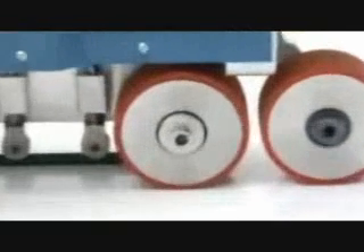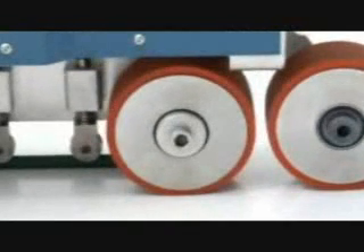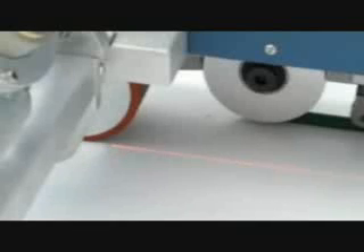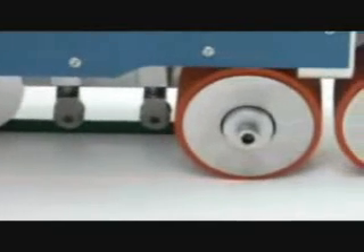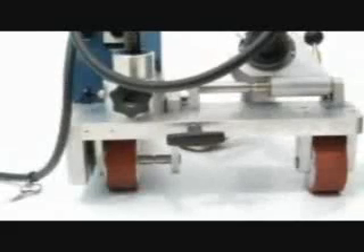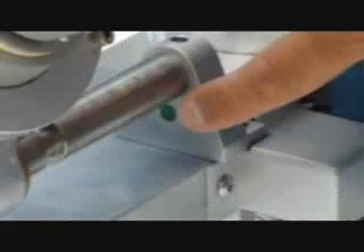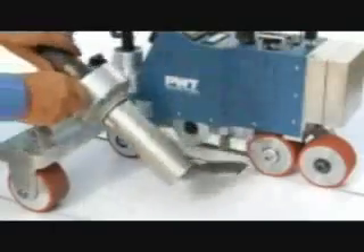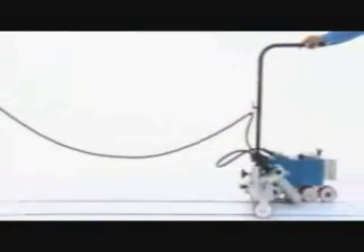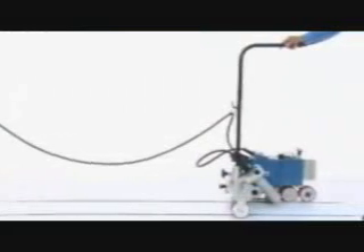The articulating drive wheel controls how straight the machine runs. Use the adjustment screws on the opposite side to control the machine's tracking. A laser guide runs from the steering wheel to the articulating wheel to help line up your seam. The steering wheel can be positioned to roll on one side of the seam or directly on the seam. A proximity switch senses when the torch has been engaged — once the switch is tripped, the machine automatically starts rolling. As the machine welds, you can walk with it in the forward position and make minor steering adjustments using the handle and the laser guide.